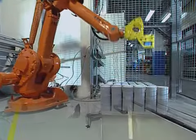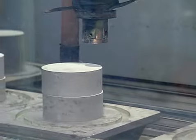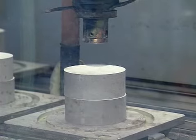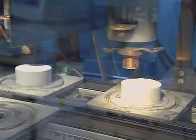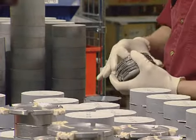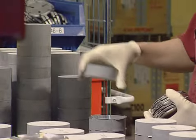All blocks go through various cycles of energy testing, in which the energy is higher than international standards stipulate. In other words, it's a demanding test that requires a high uniform quality in the blocks. The blocks are classified, which guarantees that the finished arrestors live up to their protective data.